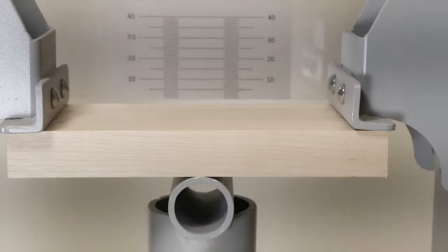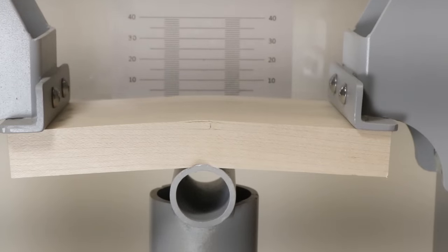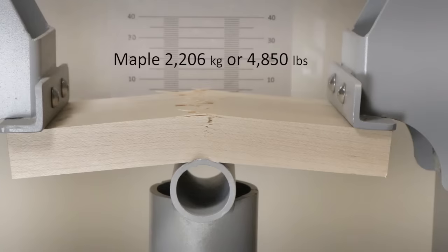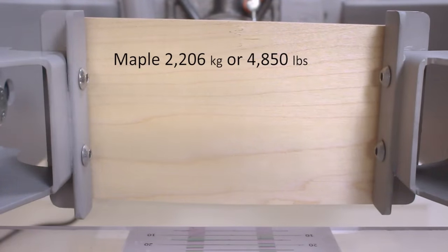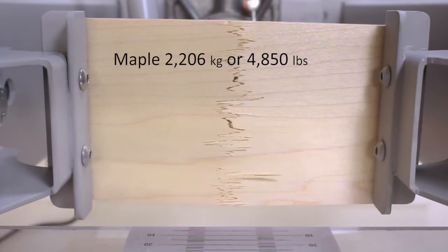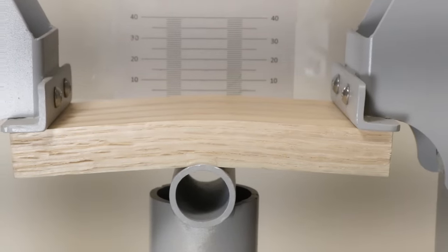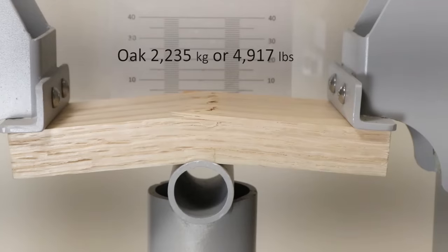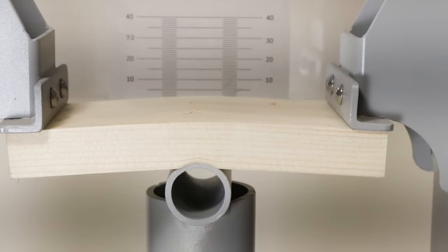Out of curiosity, just how strong is the long grain of the wood? I cut samples from the same plain stock as my small squares, but cut them twice as long so they have no joint at all. It's fascinating to watch the wood fail along its long grain — each species is a little different. In general, only the fibers on the top surface break, and usually they don't all break at the same time. The force required to break these samples was huge compared to the glued-up pairs. After measuring these forces, we can now see what contributes the most to the strength of complex furniture joints. The long cellulose fibers are so much stronger than either the lignin or the wood glue that the strongest joints are ones that maximize the amount of long grain that crosses the joint.